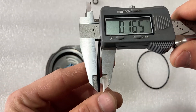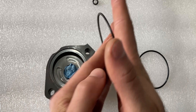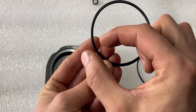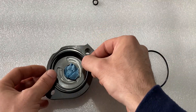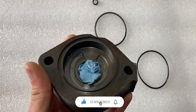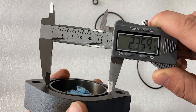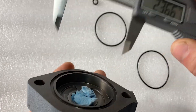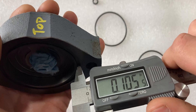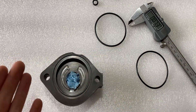The cross section one way is 0.102 inches and the other way is 0.091 inches — it was squeezed between two faces. This is the old o-ring and it still fits, but it will not seal as well as a brand new one. Measuring the ID of the groove we get approximately 2.36, and the groove width was around 0.106 inches. With those two measurements I'll look them up on the chart.